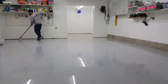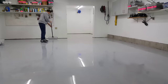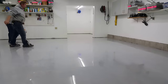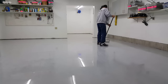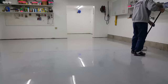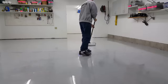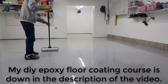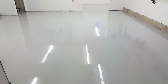Now we're putting the topcoat on — this is a urethane, a polyurethane topcoat. A lot of companies have a clear version and also a pigmented version so you can put down the same color as the epoxy coat. We're putting down a light gray urethane topcoat. The urethane is really hard, really scratch-resistant, and it just protects the epoxy to give you a really long-lasting floor. That's the basics of how to do an epoxy concrete floor coating the right way. Check out my course in the description, and this is what the floor looks like when you're done. Thanks for watching!